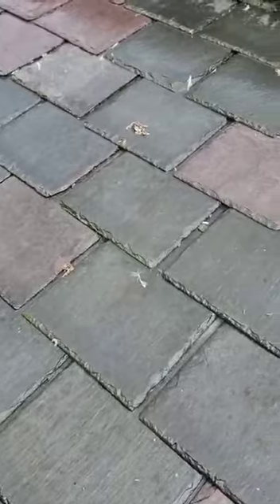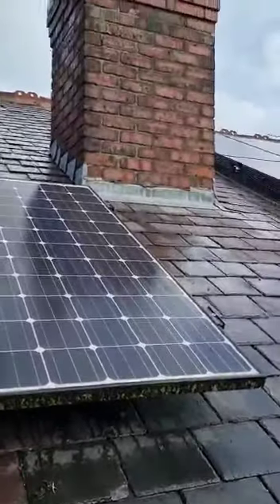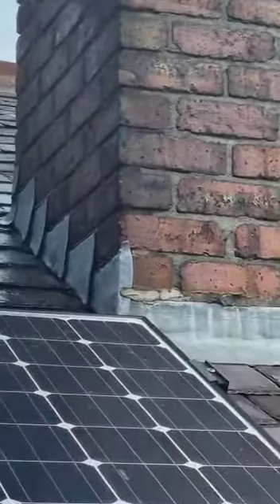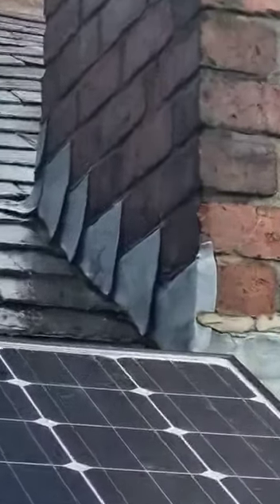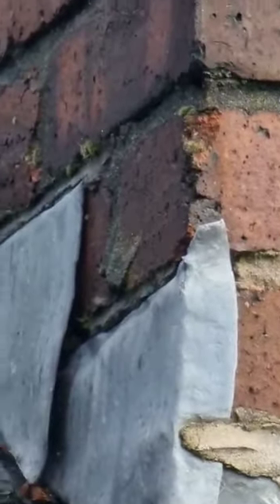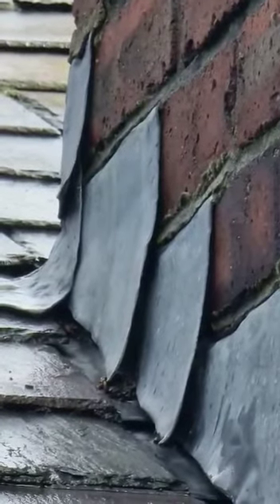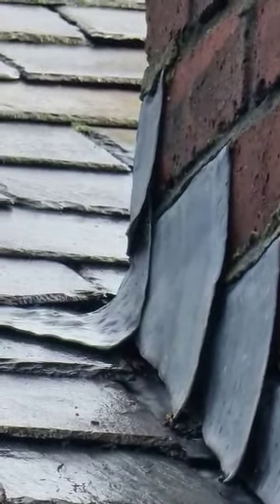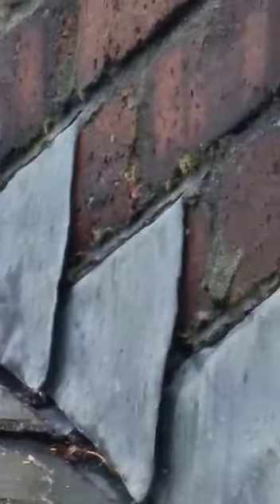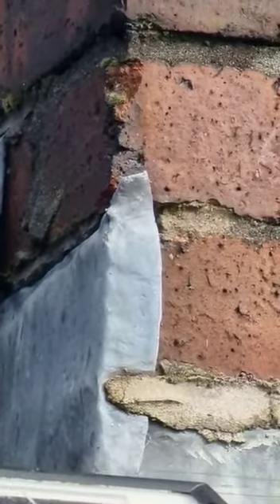On the perimeter, the slates are in good condition. The chimney — I'm actually surprised, because after looking inside and seeing the amount of staining going down the wall, I expected some flashings to be missing. They are fixed with cement, which is something to address. While we're up here, I'll grind this out and refix them with lead plugs.